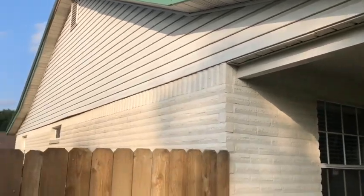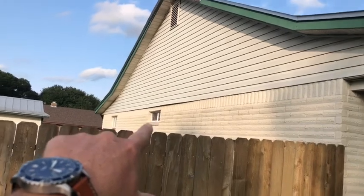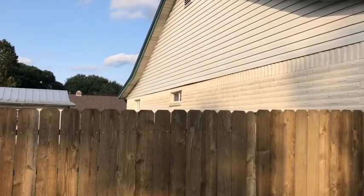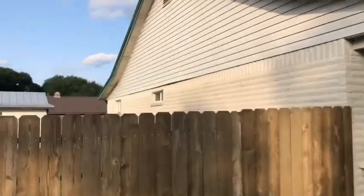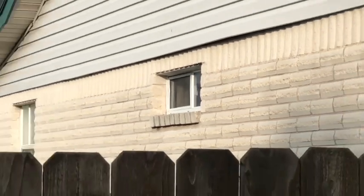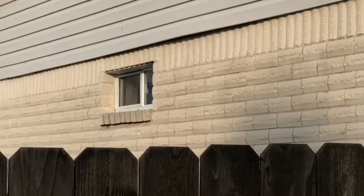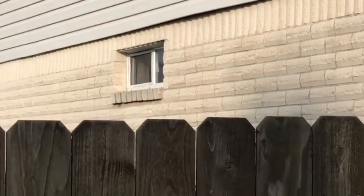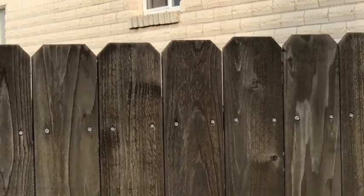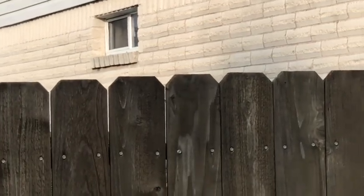Might as well just do this side since I'm here. We've got 2 windows over here we're replacing. This window will have no grills. And Jim, this window we're going to set in up to the tile, so we've got the width of the brick to work with there. See that? We can use that brick pocket because otherwise we're going to be under minimum dimension for the height. We've got 12 1/4 inches brick to brick out here, and we've got the depth. So we're just going to put that window up to the tile interior, and then we don't have to worry about making it smaller or cutting tile.